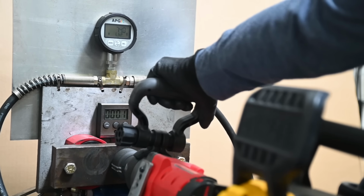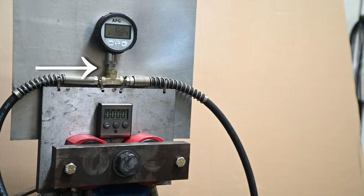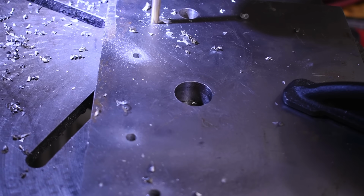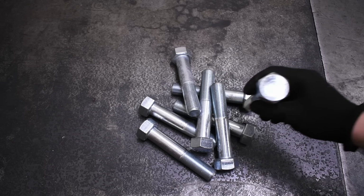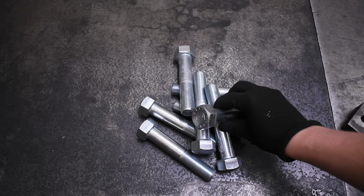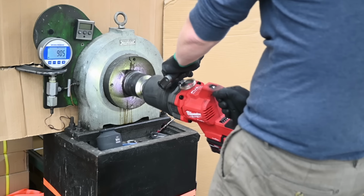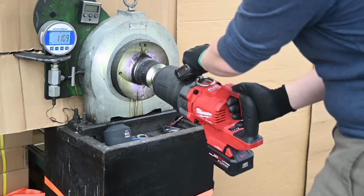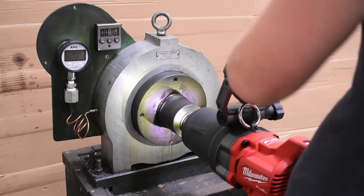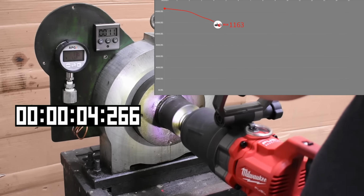What's going to have to take an L for now is our dyno. Yeah, she's not cut out for 10 seconds plus if we're already cresting 1,000 foot-pounds in 5 seconds. This thing's more rated for 1,250 or so, but above 1,150, the data starts to become worse and worse as that bolt stretches. But fear not, we got this massive Skidmore here, ready to take all the beans, no problem. This is, however, a forward Skidmore torque machine, so no way to tighten things up in reverse like on our dyno. So we'll need to tighten up this nut first, then run her on the dyno in a removing style dyno graph that we've done before with cordless 1-inch impacts and have that data to compare to.